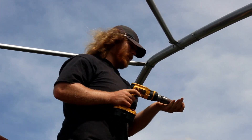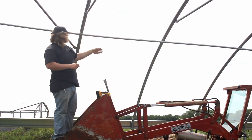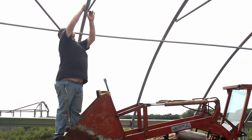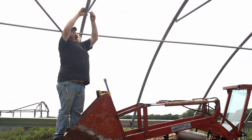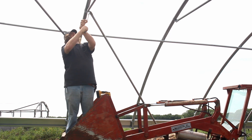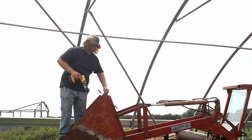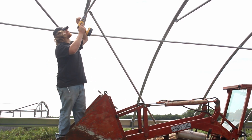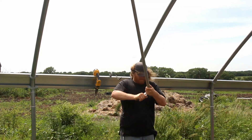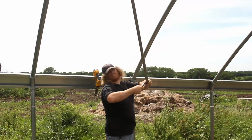Just like the rest of these brackets, once it's on. For the second brace that goes from the second hoop down to the third one, you don't have to measure — you just butt the bracket right up against the bracket for the bracing that goes across the hoop. Go ahead and hold it up to about the correct angle and tighten it down. Another self-drilling screw — when you're putting them in above you, make sure you have safety glasses on. It makes it easier if you go ahead and just twist this a little, that's all it takes. You can kind of just hold it up there and get lined up — you can see now that it sets in the same orientation so it's not twisted in comparison.